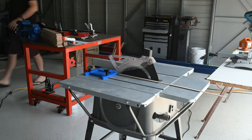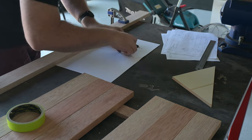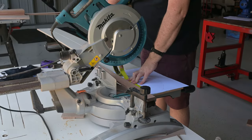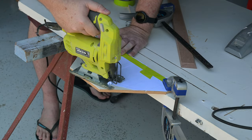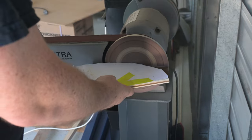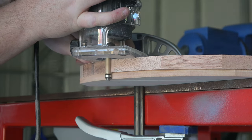I will need to sort out some dust collection though. To make the side panels, I glued three pieces of Meranti together for each face, and while it was drying, I drew a template on some paper taking the measurements from the CAD model, with the intention of transferring it to a scrap piece of MDF. I cut the drawing where it would line up with the straight edge of the MDF, taped it on, then cut it to length on the drop saw, roughly cut off the corners, and cut out the shape with the jigsaw. It was then ground down to its final dimensions using the disc sander. With the template done and the glue dry, the panels were cut close to their final size, and using the palm router with a flush trim bit, I used that template as a guide. Then they were done.